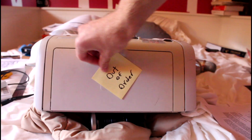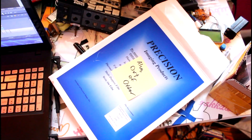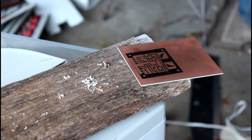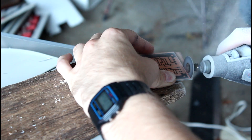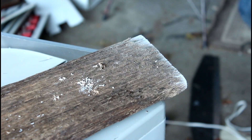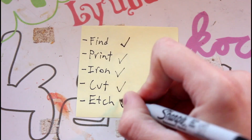Now, if you don't have access to a laser printer or transparency sheets, you can simply draw your PCB design right on the board with permanent marker. It might not look great, but at least it's something to start out with. If you want to trim your board, do so right about now. You can save the leftover copper pieces for future projects. And now it should be ready to etch.